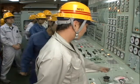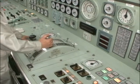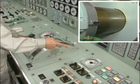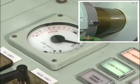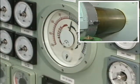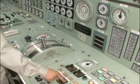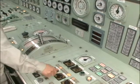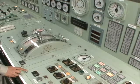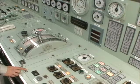Lever control mode is a method to manipulate the maneuvering valve electrically and hydraulically via remote control. Direct switch control mode uses switches for direct control on the control room console to directly open or close the maneuvering valve electrically and hydraulically, in the event the lever control mode control circuit has failed.